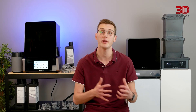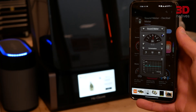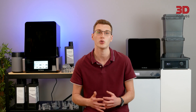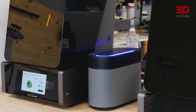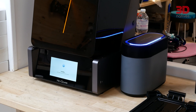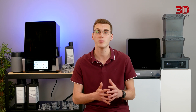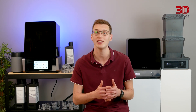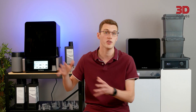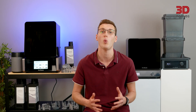We were positively surprised by the accompanying phone app, which keeps you updated on the different stages of the whole resin printing process. However, noise levels during operations are a point to consider — both the printer and the post-processing units can generate a significant amount of noise, especially when the pulsing release module is engaged. The compressor used for the pulsing release module running throughout the print can be disruptive in certain environments. We tested the printer both with and without the pulsing release module, and were surprised to see some resins weren't compatible with this module, at least in the slicer. Even with the module installed, it is possible to print without it. We also noted that the slicer only allowed slicing at 30 microns layer height for some materials with the PRM, but it was possible to print them at 50 microns layer height without it. All in all, we did notice runtime reduction when using the PRM, but no reduction in support when using the one-click-to-slice feature.